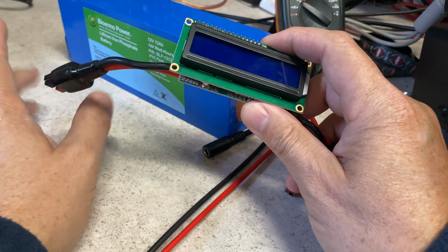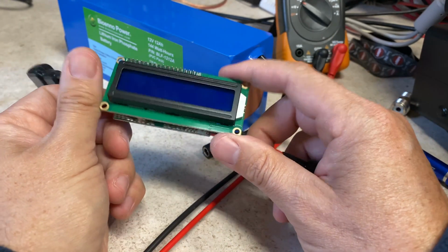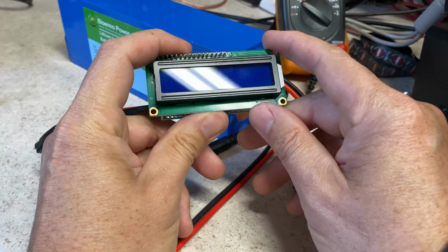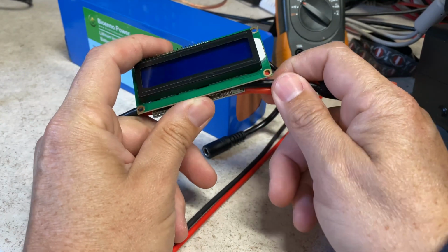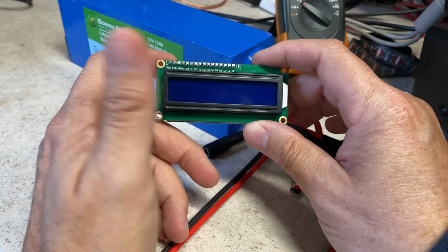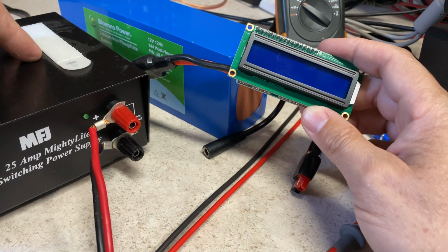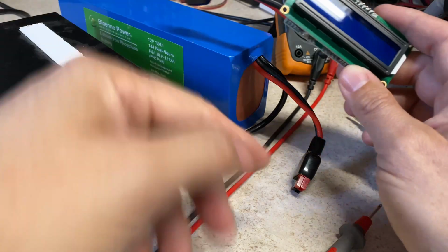Then I turned off the rocker switch on the power supply, and it was still showing power. I proceeded to play radio, and I only got about half of the life I was expecting out of the battery. Not a big deal, it was time to go back to sleep anyway, but I was scratching my head as to why. My guess is that there is enough draw from here that this thing was burning whatever power this thing was feeding through.